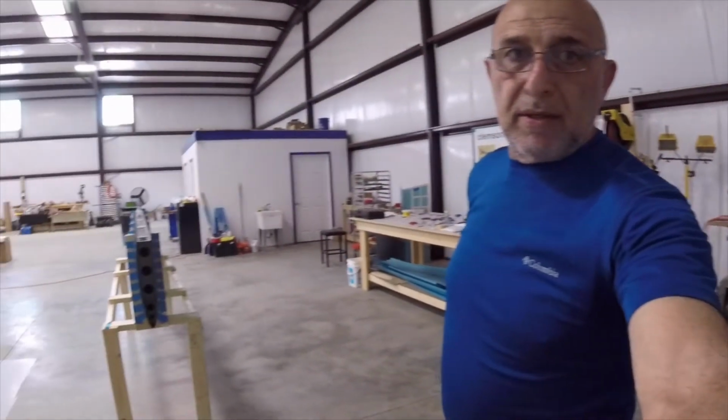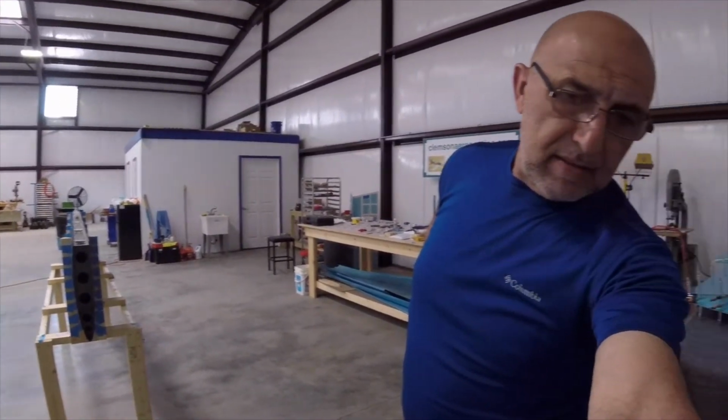I tried it. I have my horizontal stabilizer built, as you can see right here, and it worked out good. I mean, there's hardly any space at all between them. We have to consider priming. When you are dimpling, you don't have any choice as far as the depth is concerned, because the die is what's going to determine the depth. But when you are countersinking, you're the one that's going to determine the depth. So you have to bear in mind the primer.